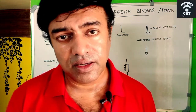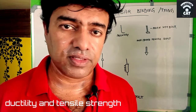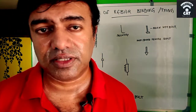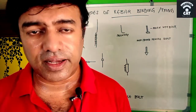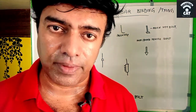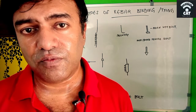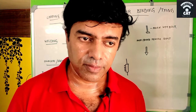The properties of the steel — the reinforcement bar — at the welded area are already lost because of the welding. Properties like ductility and tensile strength are lost. If gas pressure welding is used, it is very expensive. If there is an earthquake, the first place to crack or break will be the area where welding has been done. So never go for welding in rebars and reinforcement.